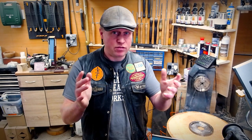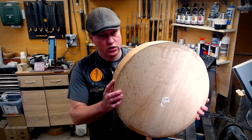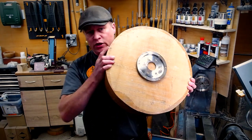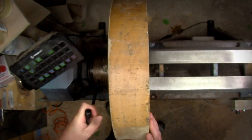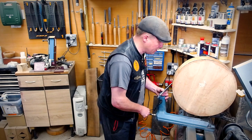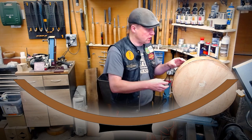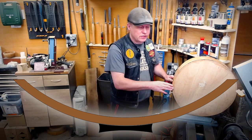You've just seen the finished piece. Now let's rewind and take a look at the very large lump of sycamore we're going to use to make that bowl. It's about 19 by 4 inches. It's mounted to a very large chuck-mounted faceplate and it's going to go on a large set of jaws on a Supernova chuck. Make sure the two keys are nice and tight. Here is a diagram of the bowl I've drawn on the computer. I took the maximum dimensions off the blank, and this is what I'm going for. It's a two-part bowl — really quite large.